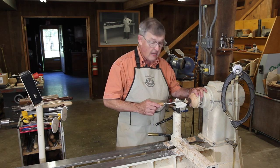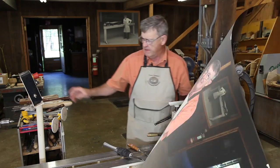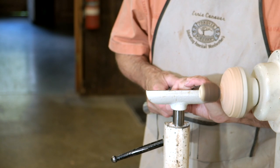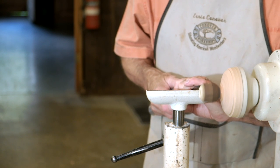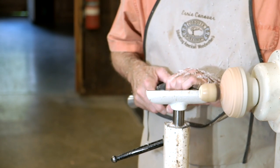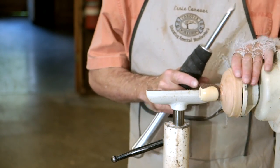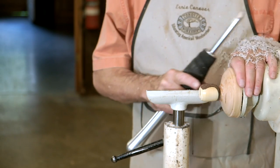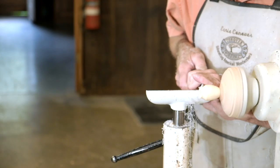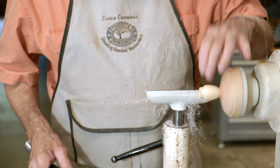We've now got a nice inside turned and we'll now turn the outside to match it. Now we're going to use our spindle gouge to shape the outside of this, taking very light cuts. See that nice ivory color coming up? You can see we still have some of the rind of the nut there — I often leave some of that to show that it is tagua nut; it can make the turning more interesting. You can see the polish I'm getting right off the tools with a really sharp tool with a rubbing bevel — that's what you want.